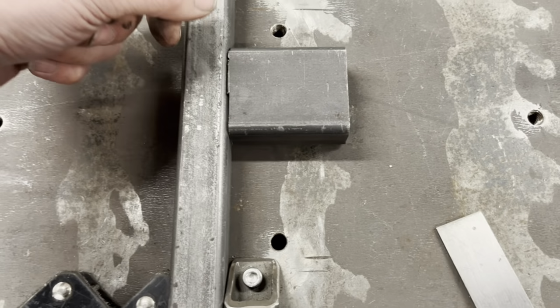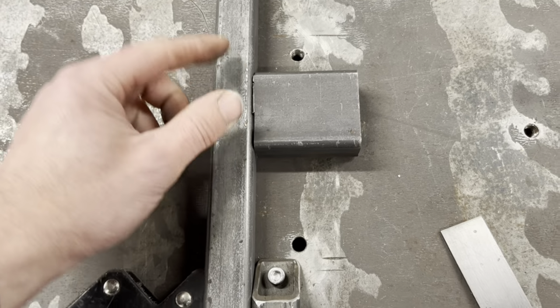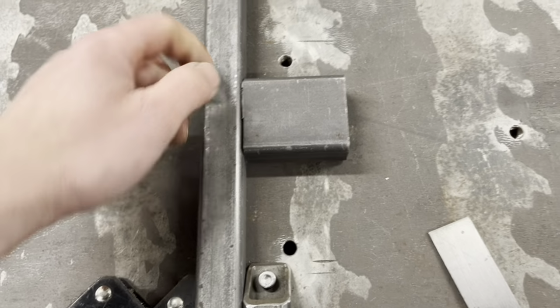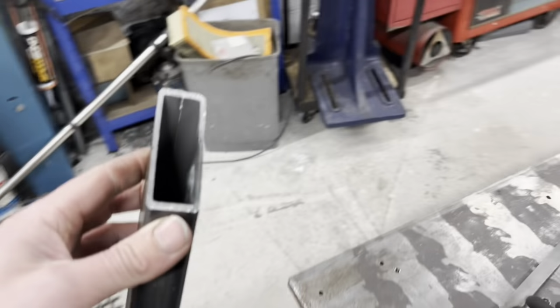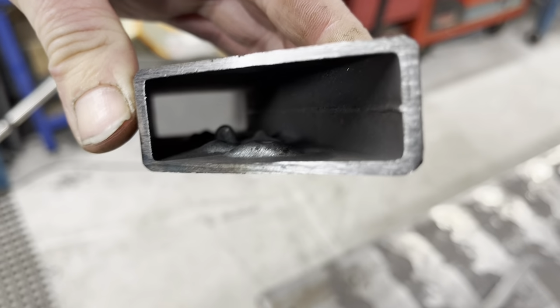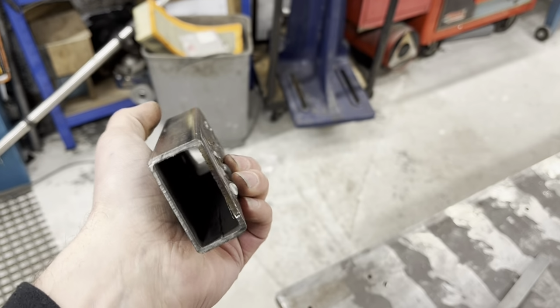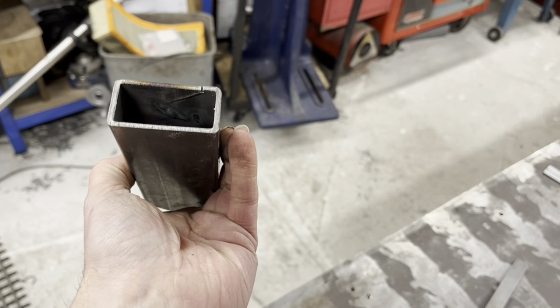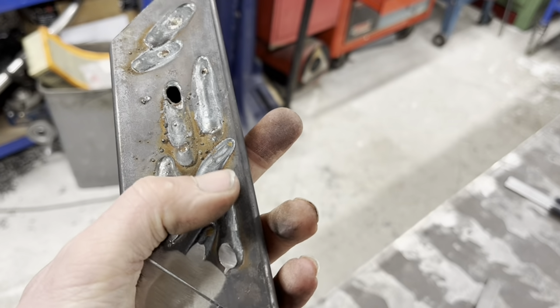So you're going to arc up and you're slowly going to bring it. So you are filling that. And the slower you go, that's why you have to be careful on your temperatures, your powers, like what I showed you on that bit of metal earlier. This one. If you go slow, but you've got your welder up too high, you will melt the steel away inside. Yeah? You need it so you've got a nice burn but you're not sacrificing. You see that one there on the right? Which is this weld here.